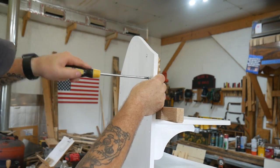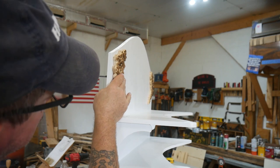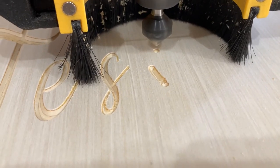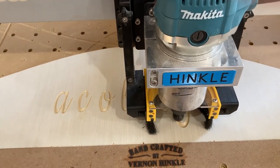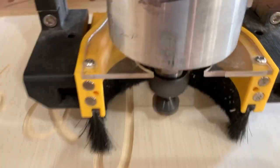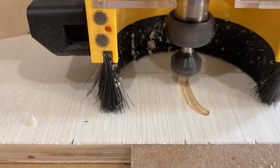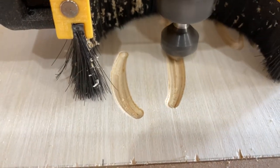I do this by hand to be safe — backing them out and forcing them back in. It wanted to push the carving off the surface of the shelf because I didn't penetrate very far into the back for fear of going through the front. Now here's a great mistake — this was supposed to be the practice piece, but after finishing the carving I really liked the way the off-white looked with the letters carved into it, so this piece became the sign. It's actually one of the cutoffs from the shelves, so I had to change the outside corner profile and oiled it. It's amazing what you can do with those V-bits.